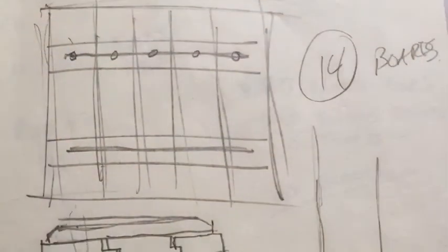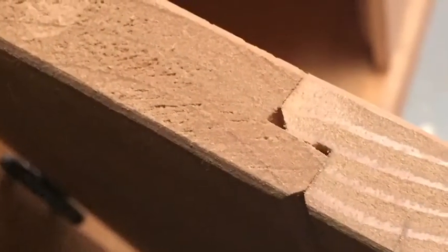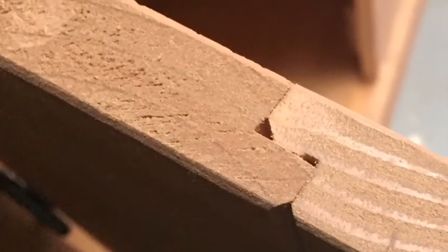You can see here on the drawing that I did a rough sketch of how I was going to do the lap joints, and that was done so that I could figure out that some of the boards were wider than others — you can't just make them all the same because some have to extend behind the other pieces like this. Then the chamfers were all done with a number 72 chamfer plane from Stanley.